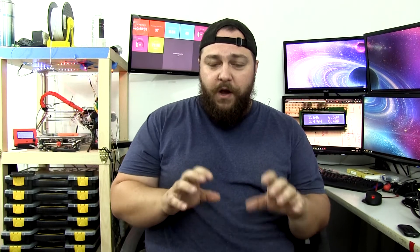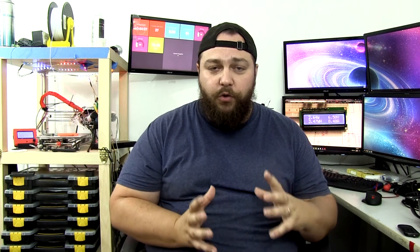Now that we've done the testing, the next part is going to be to connect everything together. We're going to work on building a 3D printed sleeve to connect the two axles from the treadmill motor to the bike trainer. Once we have that, we can start actually generating power. To make sure we don't overload the batteries, we're going to build a solar charge controller that we'll retrofit to work with this — if we get overvoltage, it'll dump to a dummy load.